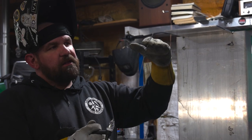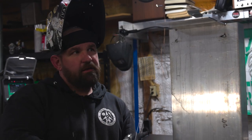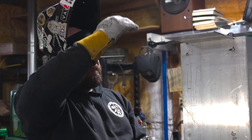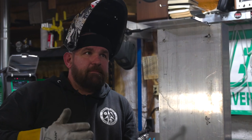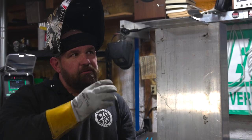You come into this a lot — I see overhead a lot when you're doing boat repairs. That's pretty much all you're running on a boat is overhead, unless something's cracked up on top of the deck. Usually it's all hull repairs, so you're overhead or slightly 15-20 degrees down from overhead, but still pretty much above you. That's where this really comes into play. I see a lot of guys get stressed out — 'oh, it's overhead, it's going to be so much harder.' Really, it's not that bad, especially if you've run a lot of vertical and a lot of horizontal. You get on some overhead and you're like, 'a little break.' So we're going to run a couple passes and show you guys some things to look out for.